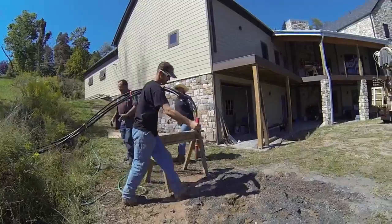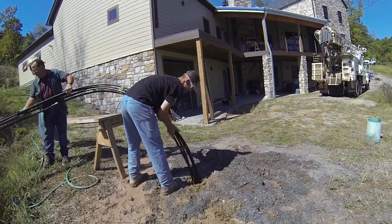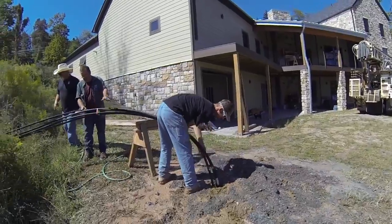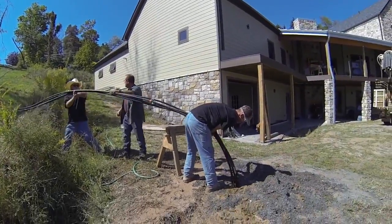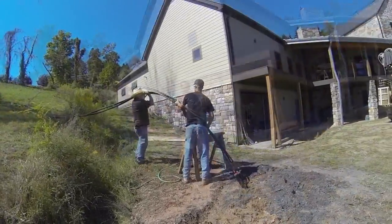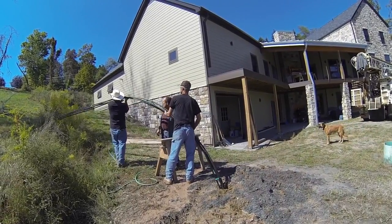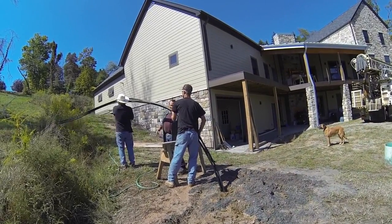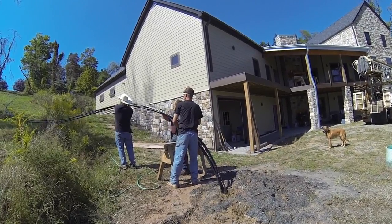We've prepared the double 3/4 inch U-tubes by laying them out to ease installation. Once the weight is inserted into the hole, the tubes will literally fall until they encounter the groundwater table, and then they become buoyant. To get the assembly completely inserted, water is pumped into the tubes, and the assembly settles to the bottom of the bore.